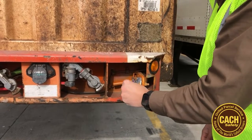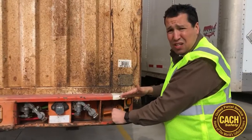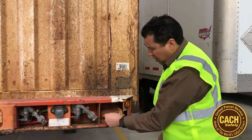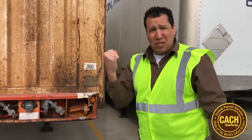It's roadworthy. Please remember that it's your responsibility to pre-trip these containers on chassis. Make sure both the front pins are all the way in, they're latched, and you put a zip tie on it. Make sure in the back the cams are twisted, they're latched, and you put a zip tie on it.